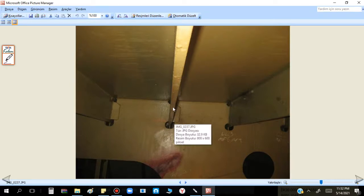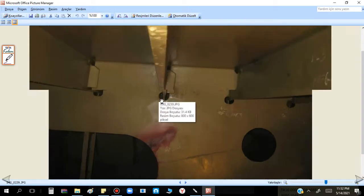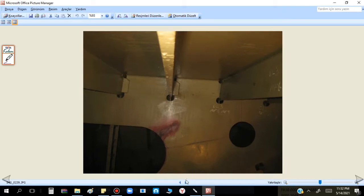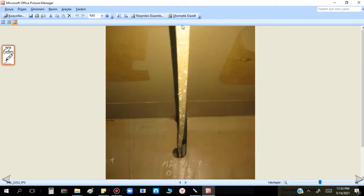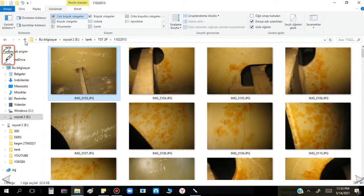And here you see the problem — in the longitudinal frame it is waving. You see this is TST — this is not straight, it has some wave. This vessel was not a good vessel. Because of the welding they bent, and these frames are very, very thin. No good, my friend. Don't forget to check the longitudinals — if they have waving. If too much, it will be a problem.